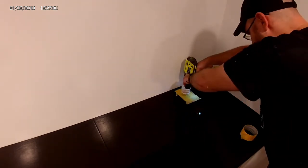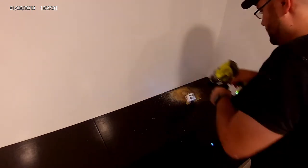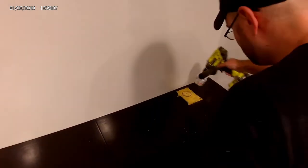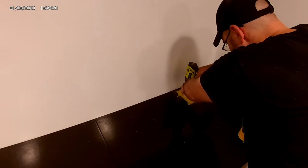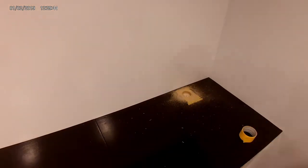Now, this is the part that I'm talking about where I had some delaminating. And delaminating is just a bubble in your finish because underneath it has separated from the wood. And it's really problematic, and I've had it here. I had it the most with poplar finished plywood than I've ever had before. Typically I use birch, and with birch I can't remember having a problem. Either I've lucked out or poplar's problematic plywood. So I'm always going to recommend birch.